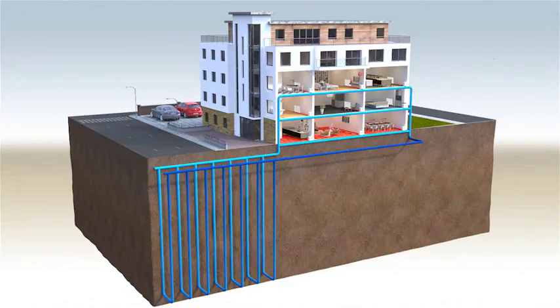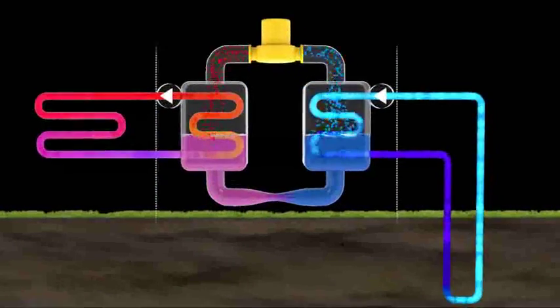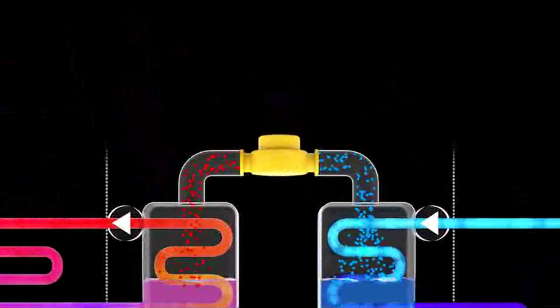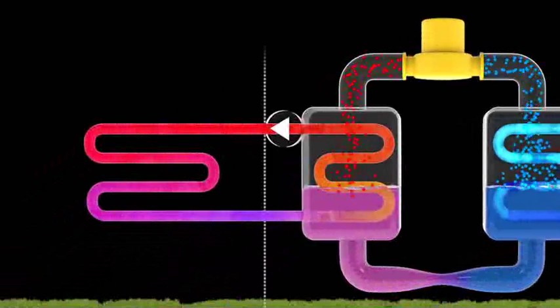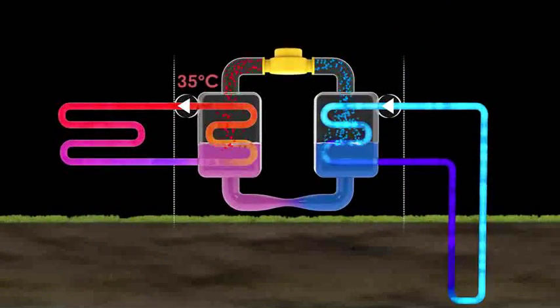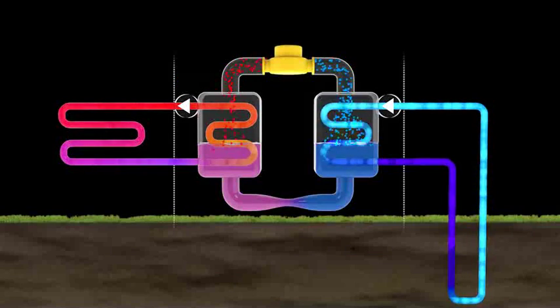Like a conventional ground-source heat pump, the Shoebox Heat Pump operates by extracting large volumes of low-grade heat from the ground, and through the compressor circuit, upgrading this into heat that can be used to provide space heating and hot water. When in space heating mode, operating at around 35°C into an underfloor heating system, the heat pump can operate with an efficiency in excess of 350%. In domestic hot water mode, temperatures of up to 65°C can be achieved, which is higher than most conventional ground-source heat pumps available on the market.